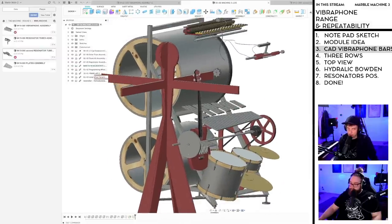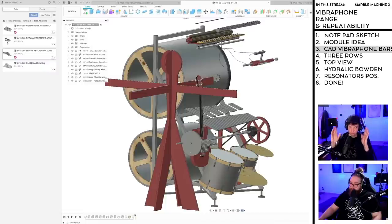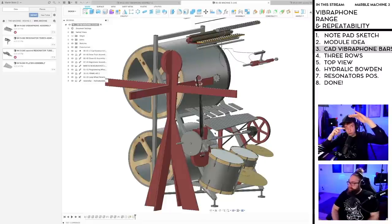So, there's a nice physics reason why a closed resonator has half the length: the sound comes down, bounces off the closed wall and goes up again. So the wavelength is double, thanks to the fact that you have closed the pipes. So when you open the pipe again, you have to make it twice as long.